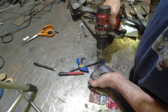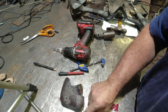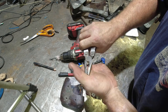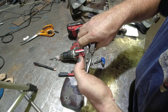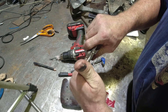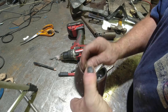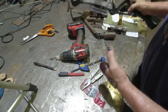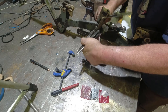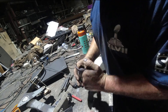I just drill the holes into the socket. Next I take T-nuts and flatten out the little spikes — that's what I use on the inside of the socket when I'm trying to bolt the socket to something. Then I start working it onto the bracket. I found it was much easier if I took the bracket off the bow when trying to bolt this together, and then finding the rotation points to see where everything really lined up.